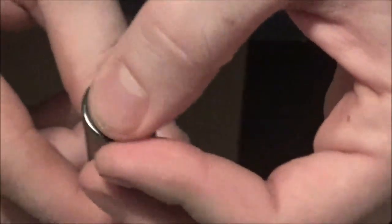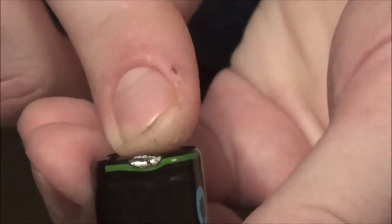Talking about your basic 18650, there are some do's and don'ts when it comes to 18650s. So this is an up-close view of an 18650. This is what we would consider in a vape shop a bad battery that needs to be rewrapped at least. Typically there's no scarring on the bottom, but the thing that draws a lot of issues is this right here. This is a tear in the battery. This is something that you definitely do not want to use, because it can cause a hard short if it touches the outside of the mod or anything like that. Also auto fire, because if you look inside there, it's all copper. It's going to cause it to pretty much fire on its own.